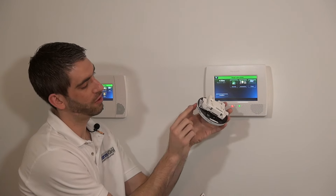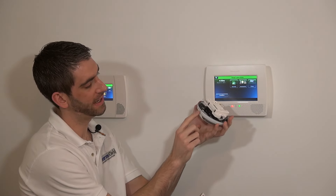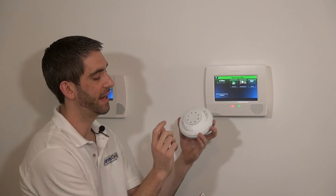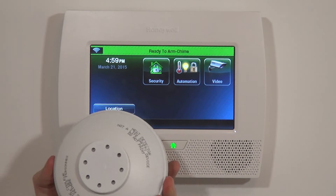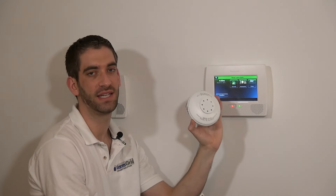You've got labeling showing you 135 is the degrees threshold and that it does rate of rise. But keep in mind, if the 135 degree fixed heat detector is triggered, you need to get a new 5809 — this is a one-time use only on the fixed heat activation.